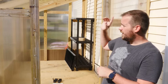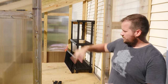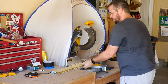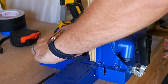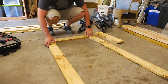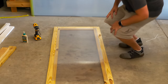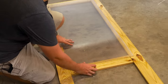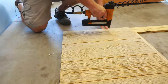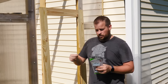While Bob's in the garage cutting up the rest of the pieces for the roof, I have to worry about the door. It doesn't need to be really heavy — we're going to use some of the same plastic for the top and some of the same trim for the bottom. I'm going to frame this out nice and simple using pocket holes and three-quarter-inch material because it doesn't need to hold a lot of weight. I've got the door made up — it fits the space just fine, and before I add the plastic I'm going to attach it to the greenhouse with spring hinges so that when you let go of the door, it just closes.